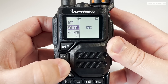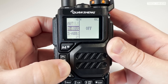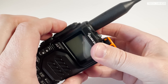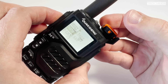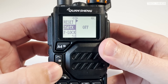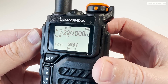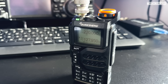If you want to transmit on the 1.25 meter band, you'll need to unlock it. To do this, power up the radio while holding the top function button along with the PTT. You'll be presented with a menu where you can turn on or off certain bands for transmit. Unfortunately, it doesn't unlock transmit for the 6 or 4 meter bands, but it does receive on those as standard — a bit of a shame.